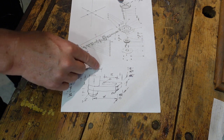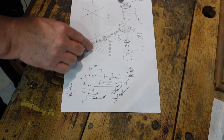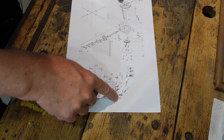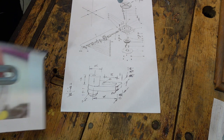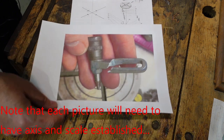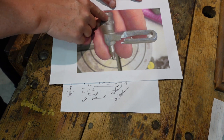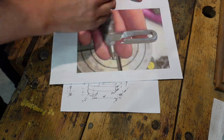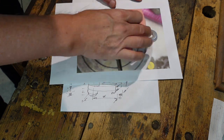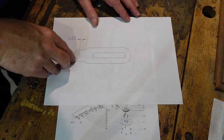EMCO is Swiss and the design is probably metric, so 16 millimeters there is 16 millimeters, not five-eighths. Sometimes designers will pick a dimension for certain reasons and you're stuck with it. When scaling off a drawing like this you can look at it and make a few guesses - is it 16 or is it five-eighths? This is also where the photo comes in. If you can blow these up to life size it really helps, because you can say that diameter is 12.5 and use that to work out other heights and diameters.